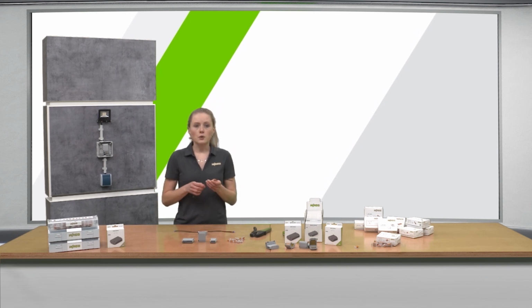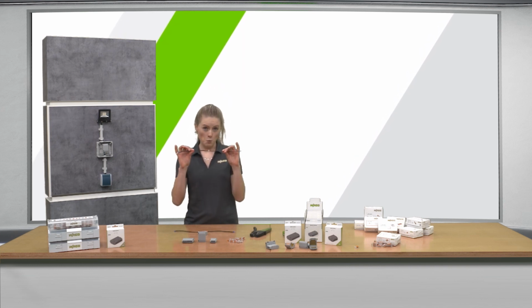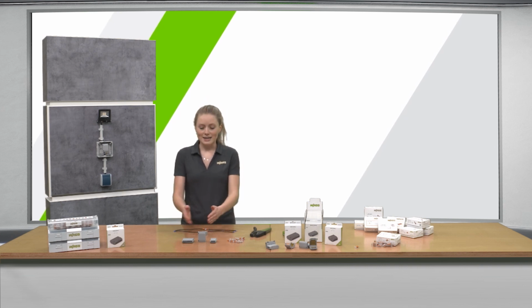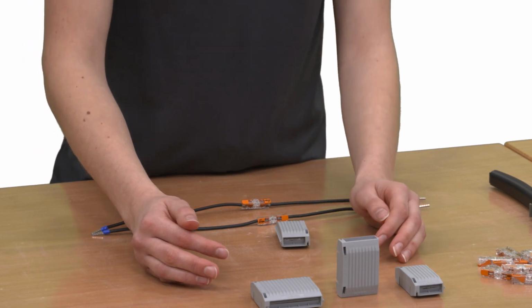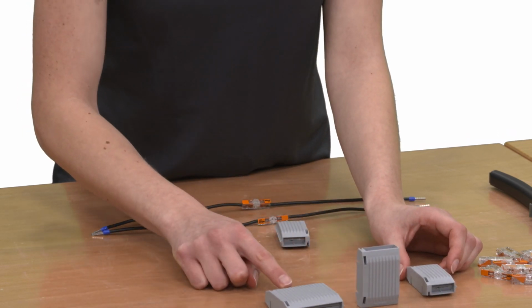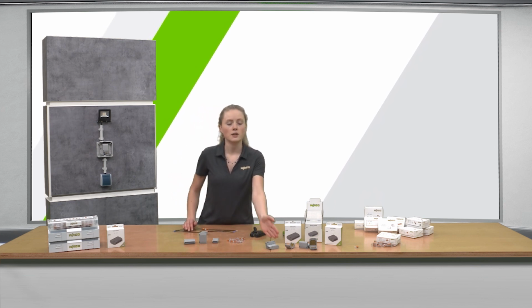With the new inline connector of the 221 series, you now have the possibility to wire directly in one direction. For wiring in through direction, we would like to offer you now also a moisture protection. And these are the new Gelboxes for our 221 inline connector. We have them in 3 different variants: 1 for 2 connectors, 1 for 3 connectors, and 1 for 5 connectors. We follow here the same concept and design as the already existing boxes you can see here.